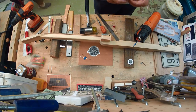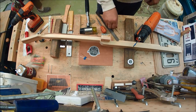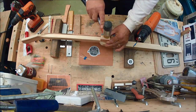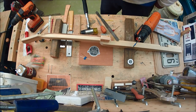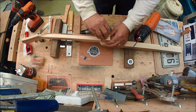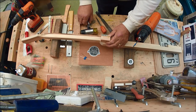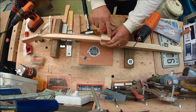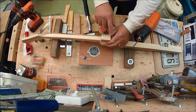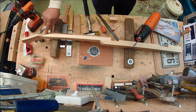So once I've drilled this hole out, I just simply put the piece of golf tee in here. Now, there's no reason why you couldn't take the golf tee and pound it in there and cut it off, but I want you to think about something. If I'm using wood and the wood matches this, there's nothing stopping me from using some type of latex paint or something. And once I know I'm close, again, I didn't glue this, I can just put a dot of paint on there, let it dry, and then just simply tap it in. And I know that it's nice and smooth and it's not going to hang up on anything. And that will give me a really nice contrast for the artist to see, because you know these places are dimly lit. Now, I'm going to pop these in quick and show you what it looks like, and we'll call it a day.